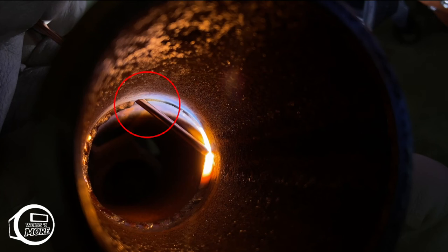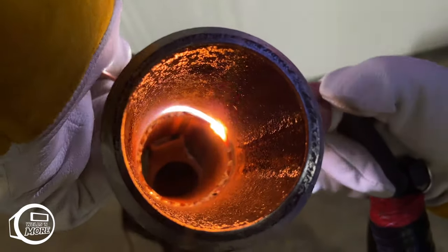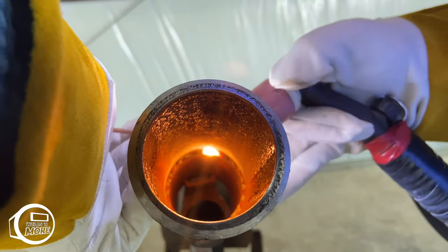Resting the wire on the weld like this helps me out. It gives me more control, and it also helps with the wire feeding process. If any of y'all have trouble losing the wire inside the pipe or the bevel, this might help y'all out a little bit. Here, after I tie in, I always like to add 2 or 3 drops on top after I close it up, so the weld could push down, and it would make it look even.